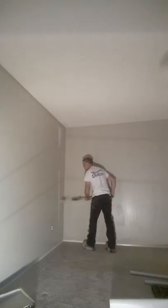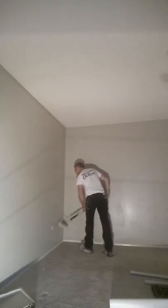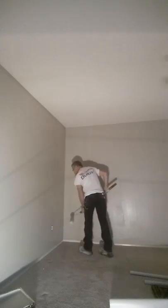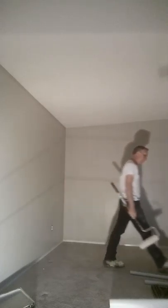This is a really good color — it's called Revere Pewter, it's a Benjamin Moore color. It covers really well over just about any color, and a lot of times you can get away with one good coat as long as you're putting enough paint on the wall and spreading it evenly.